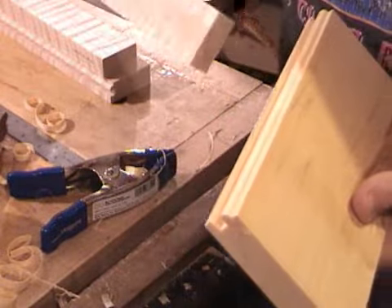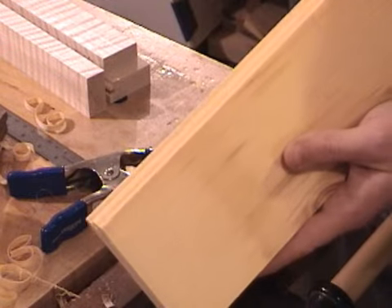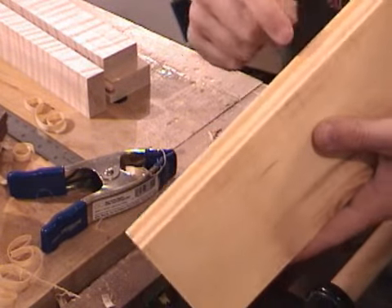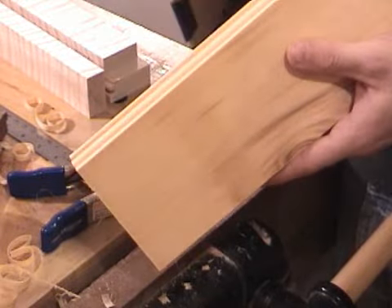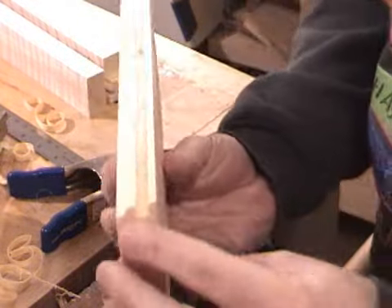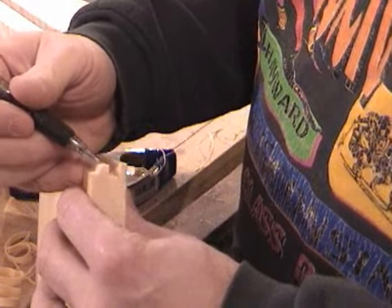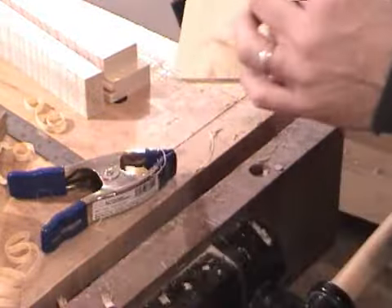If you've chosen your grain orientation of the curly maple correctly, even this process is feasible. But I will be honest with you — the wooden planes and even the rabbiting planes in this curly maple I find to be just an absolute bear. You saw how much I struggled with dishing out the bracket feet on the bottom of the case. It only gets worse, and this bead is so fragile that the way I would approach it, if you're going to use hand tools, is to use a shoulder plane. First, plow in this dado. Then use a dado plane and plow in this fillet on top. What you'd have left, once you've plowed in those two things, is a little peg — almost like a little tenon sticking out. Then come back with your shoulder plane, which you can get a nice tight mouth on, and just roll this bead over, then finish it up with a little sanding block. I think that's probably your best bet for the curly maple by hand.